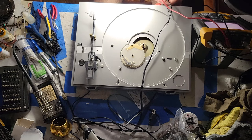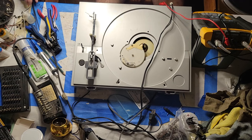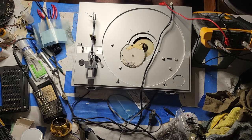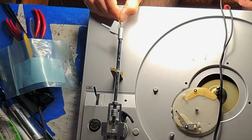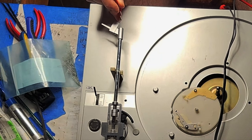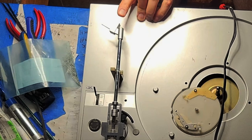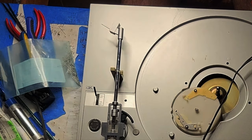Having established the connection of both the main signal wires, I think I'm going to try to put some leads in there. In my early days I would save all the snipped ends of component leads, and those can be a little bit handy for this sort of purpose. I don't want to use anything too big, but these appear to be about the same size — maybe a little bit smaller — so I won't stretch it out. Now we know something more: we do have continuity between the tonearm and the ends of the cable, which would suggest that if there is a problem, it is with the cartridge.